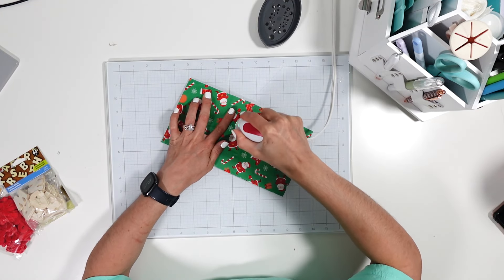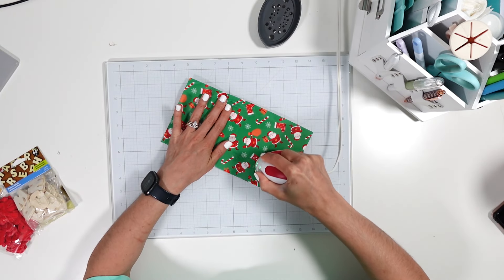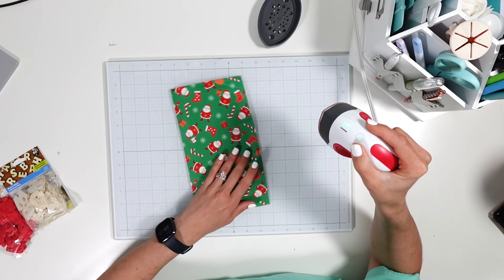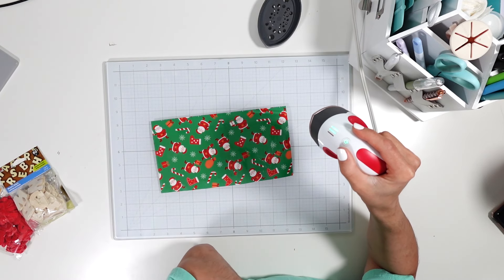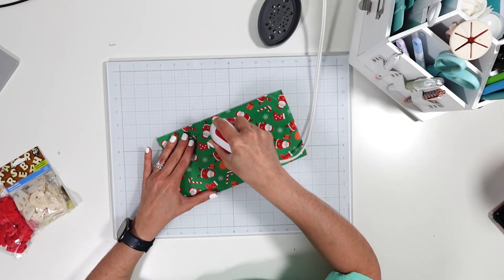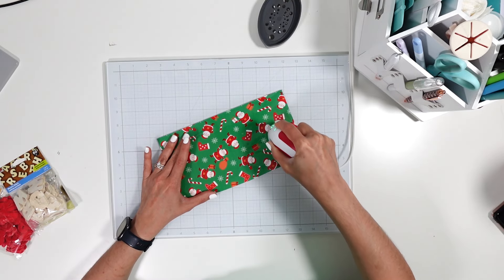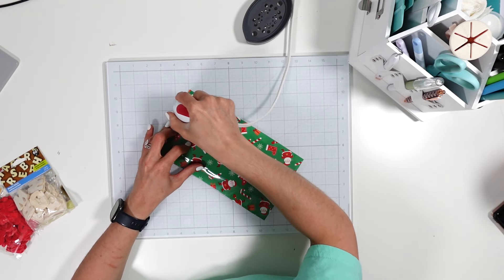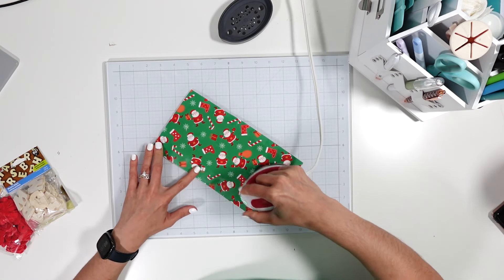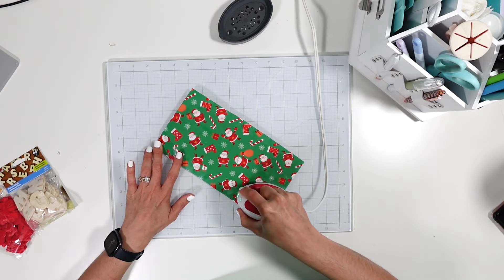Applying firm pressure as always and keeping constant movement. Now that I feel it's pretty secured and beginning to iron on, I can move to the other half. I don't necessarily have to worry about things sliding because it's beginning to adhere to the wood. Just going to go over it a little more and making sure I'm pressing down on the edge to make sure it's really ironed down.